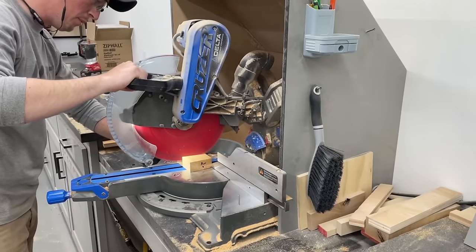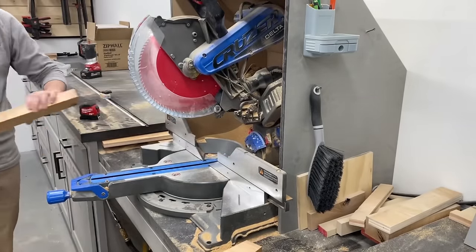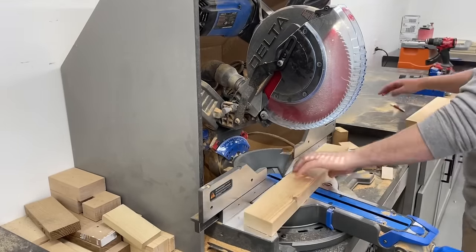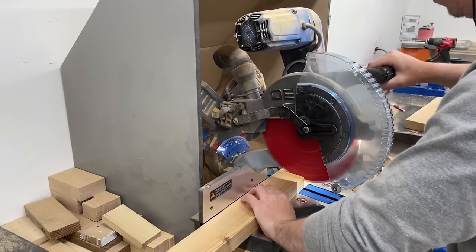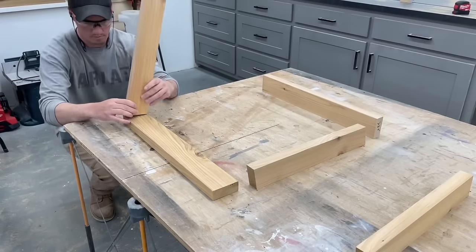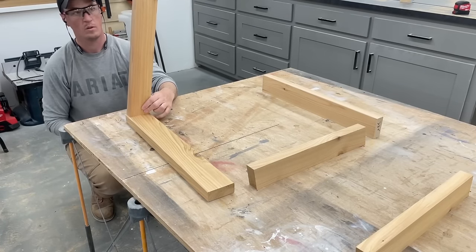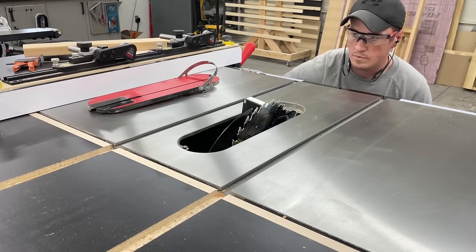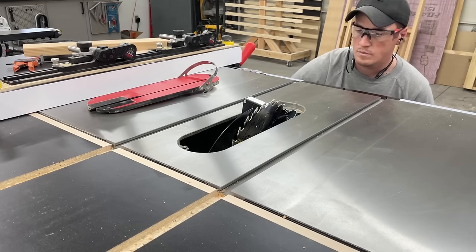The backrests are similar in construction, but here we do need to bring in some angled cuts, again for comfort. No one wants to feel like they're sitting in some bleacher seats out on the deck. With the angle cut on both ends of the vertical side pieces, next I ripped that same angle to match on the long edges of the top and bottom pieces.